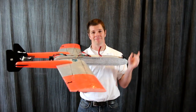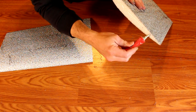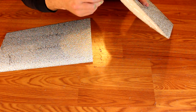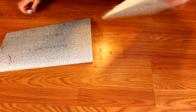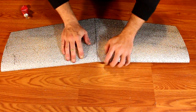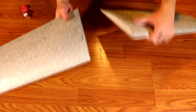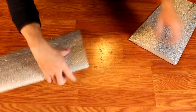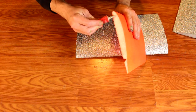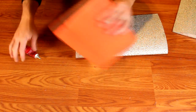So with that, let's build the airplane. Start by gluing the wings together. Apply a heavy amount of glue to the center of one of the wing cores, then press them together and work around to spread the glue, then pull them apart. Wipe your fingers down the side of the glue to make sure you've got an even coating and it's not spotty. Then set the wings aside and allow them to dry for about 10 minutes, as the glue is a contact adhesive.